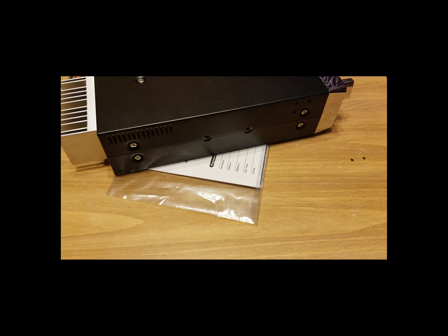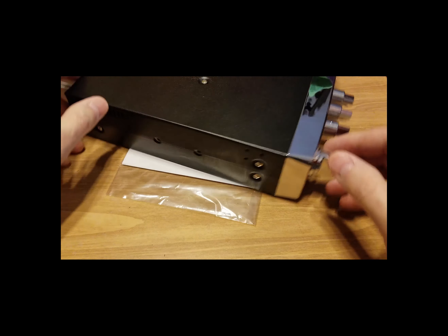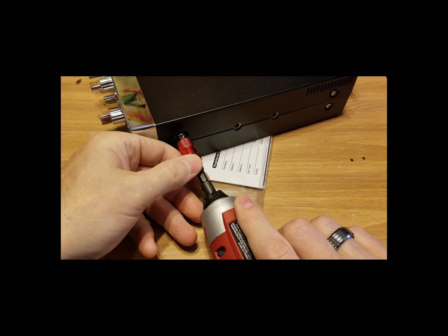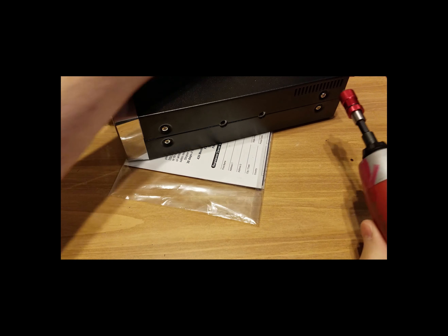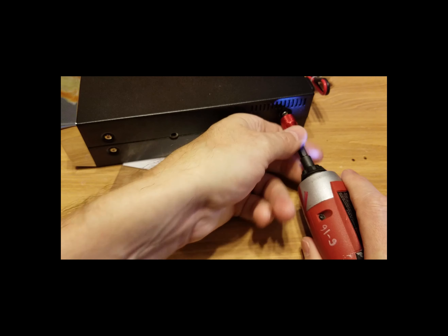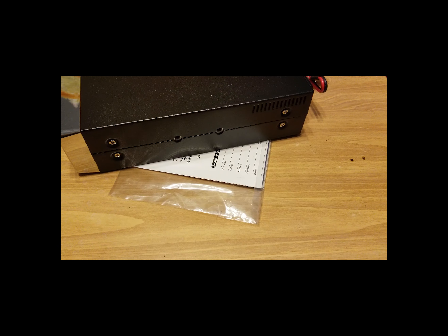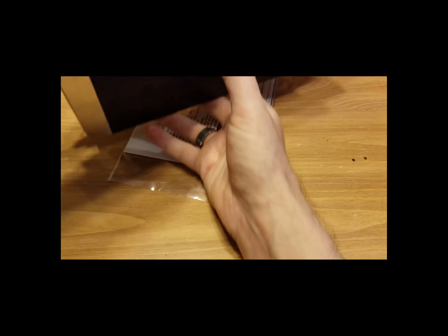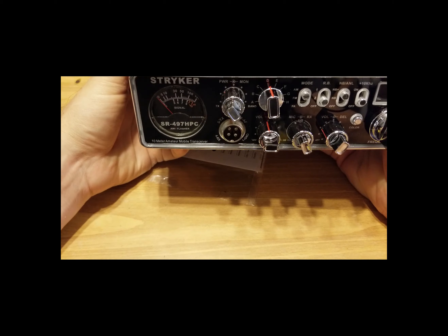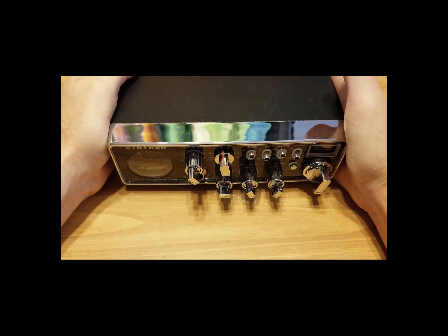This thing is an audio monster. If you're going to purchase a 497, if you don't have a good technician, buy it stock, convert it yourself by moving the jumper, and talk. If somebody cannot show you your radio on a scope and an analyzer, run — because all they're going to do is over-modulate you and make you splash four or five channels at once. That's not good.